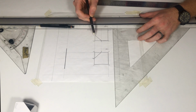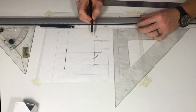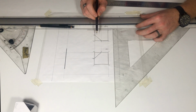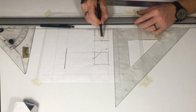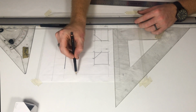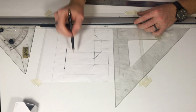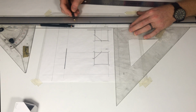And similar to this, we're going to have almost the same view, right? There's some subtle differences in the material, but the heights and things are the same. And so I don't need to remeasure these heights. In fact, I probably shouldn't, because the more I remeasure them, the more likely they're off from each other. Instead, I can use projection to bring these heights around the corner and project them along a parallel path to make these heights. This is called hinging the projection, and there are a lot of techniques to do it. I'll start with a very simple one first.